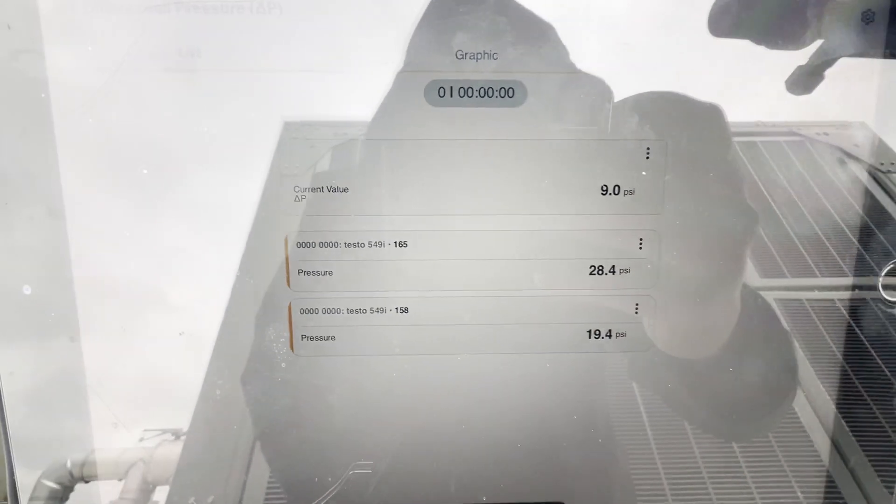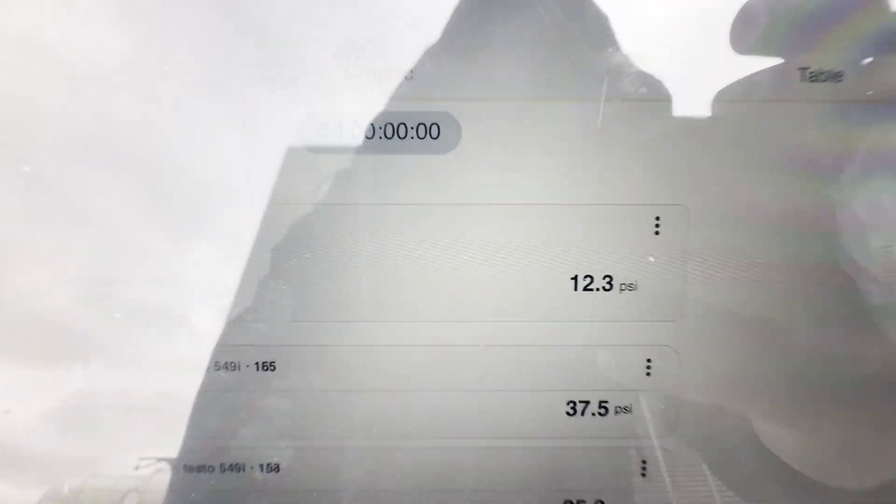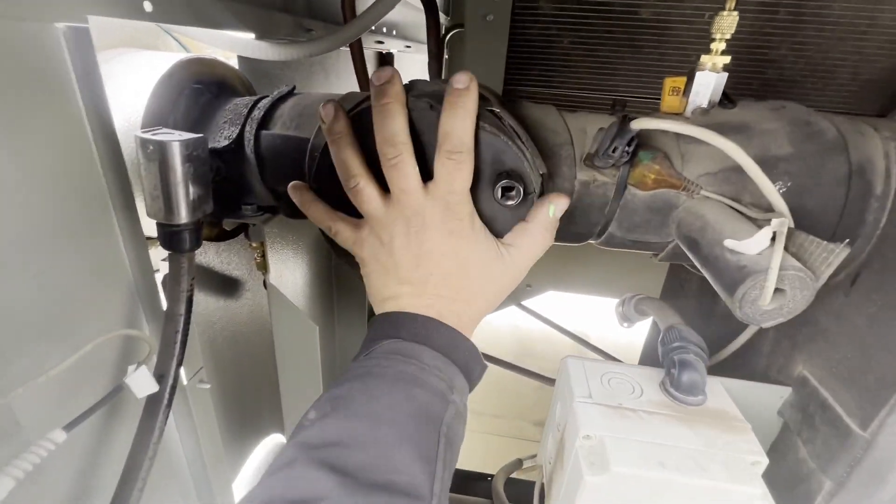It's not a great pressure drop. We've got an inlet of 35, almost 40 PSI and out of 24, making for a difference in the neighborhood of 13 PSI across this strainer here.